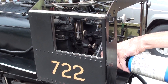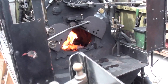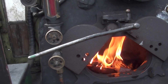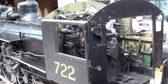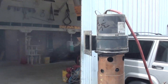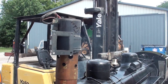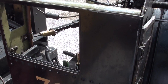I think it'll take about an hour to get steam up. It'll take a little bit. There's only two and a half gallons of water in there, so you wouldn't think it'd take that long, but it does. Here comes the smoke — you can see the smoke coming out of the blower already. There's the Johnson bar. If you have it in gear and it builds up pressure, it's going to take off on you. You've got to make sure it's in neutral.